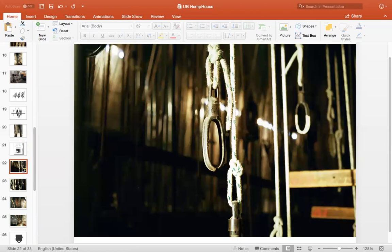Batten clamps. My Finnish friends, one of whom was with us, I'm not sure if he's still here, call these scissors. Because it's a flexible connection. These two open up, and when you pull on it, they close. If you've got no weight hanging on it, you can open and close it. But you put a batten in there, and this is designed for the old opera style wooden battens, you put weight on it, and the more tension you put on it, the tighter it becomes, and it cannot open. They're ingenious. But what you don't want to do is put the batten on the floor.